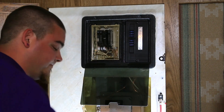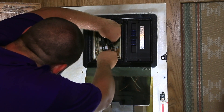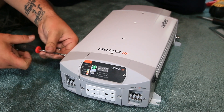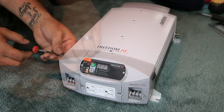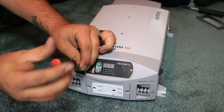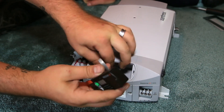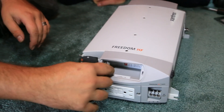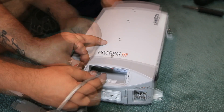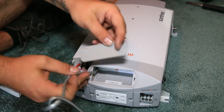Now that we're ready to set up our connections, we have already run our Romex wiring in and out of the AC panel over to where we're going to mount the inverter. We're going to prep the inverter by removing the control panel. In this situation, we're going to mount the control panel remotely. We'll run the two-pair phone communication cable from the inverter — you can actually remove the control panel from the inverter itself. This kit comes with a bezel that you remount that control panel somewhere else within the camper or coach, connect it via the phone cable, and plug it back into the circuit board on the front of the inverter. Reattach your blank cover and mount your inverter.